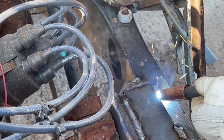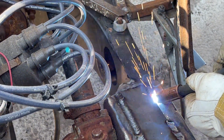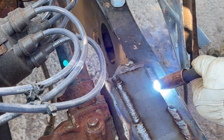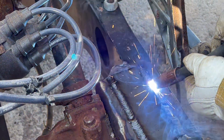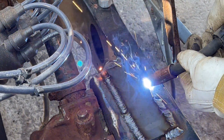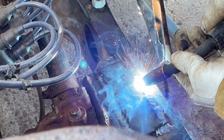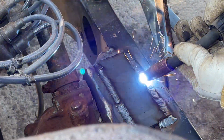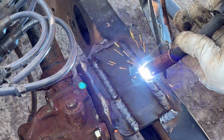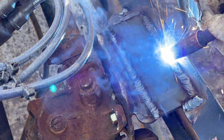Sometimes you think about things you've done after you've welded up your car, or you think you've finished, and you drive it down the road for the first couple times. Then after that, generally it's all good. You've played everything over in your brain that you think could happen, where your weak places are. And if you have any weak places, go to that memory bank where it tells you to give a little bit of help and gusset it. That's generally how I look at it. If something needs a little help, put a gusset in it. And generally, knowing when to do that is just playing it over in your brain, if something's going to move or some stressful part.